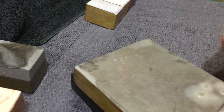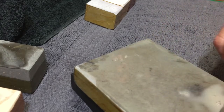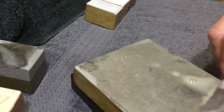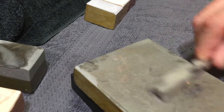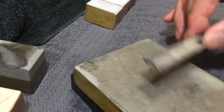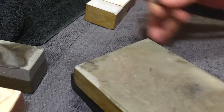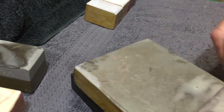More is a lot. Thicker is dense. Density and volume are two different things. So you gotta get in touch with that. So maybe a little tiny bit denser and a whole lot more on the stone, so I have a lot to work with. If I have a big stone, I might take some of the slurry I haven't started to work with and push it to the end and work up in the front, and then just sort of bring it in as I go along so I can keep the cutting action alive.